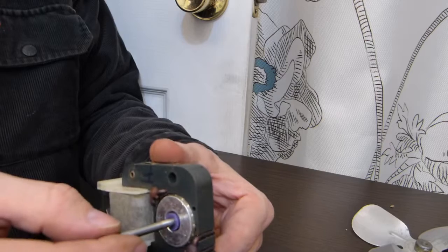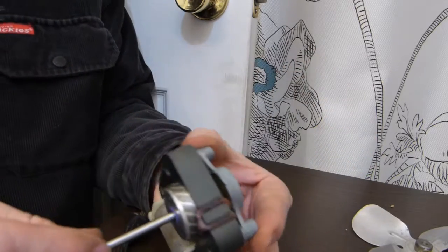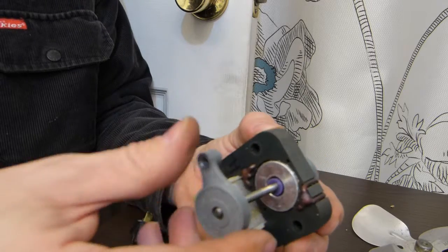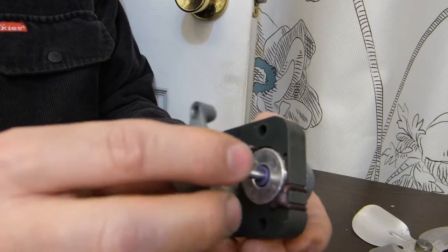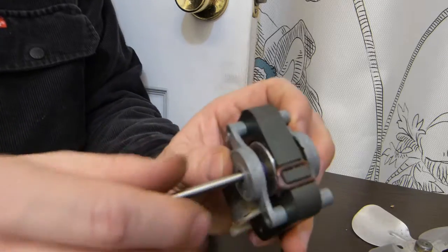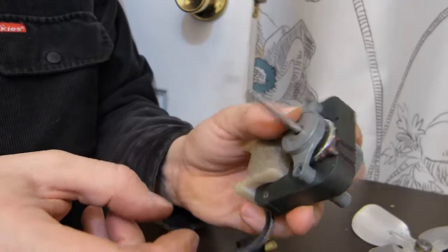This goes in the middle, and you can start doing it like so. And there, seat it in properly. The reason why this insert moves is that the two inserts can line up the rotor so that the rotor spins inside this iron core without touching anything. So it shouldn't be making contact with the side walls of this iron core. There, just test it, make sure it's actually spinning smoothly,